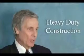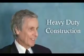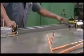The Wing coil is very ruggedly designed — heavy-duty construction is why they last seemingly forever. We do get requests occasionally to replace coils from customers who want to know if we still have the design parameters for units installed more than 30 years ago, and they want one just like the one they had. The MV coil still includes all the features that have made the Wing face and bypass coils the standard of the industry, including easily cleaned flat plate fins that are mechanically bonded to the tubes for maximum heat transfer efficiency.